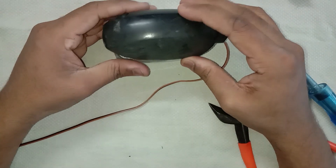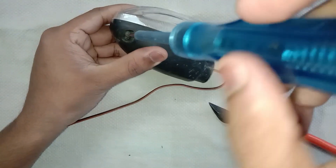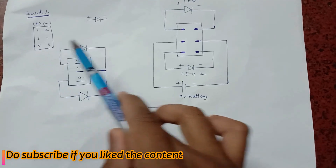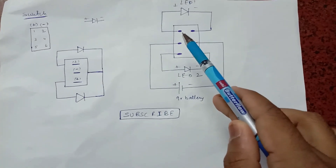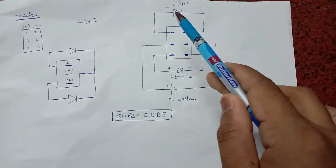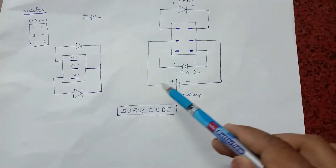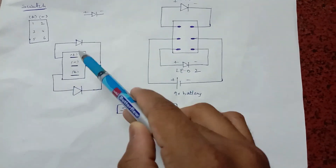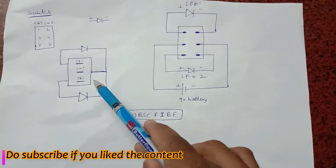The circuit is complete and we will install it on the cycle. This is just a safety gadget. This is the circuit diagram. This is the 6-terminal switch — the left side is plus and the right side is minus. There are two pins in the middle. The first part of the LED is positive and negative, the second part of the LED is positive and negative. The middle wire is connected with the 9V battery. If you have a 3-pin switch, you can connect with the 3-pin switch — connect with the middle pin and the positive and positive.